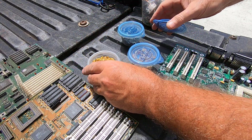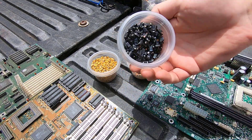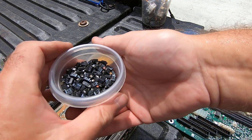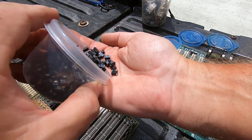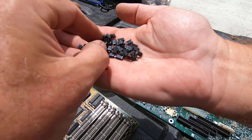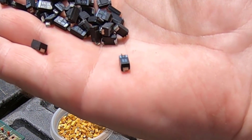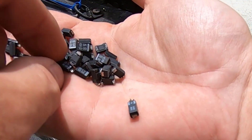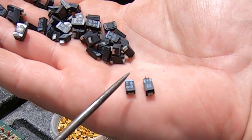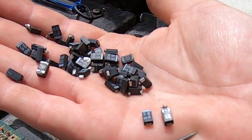So these are my working jars. I have larger containers that these get put into once these are full. And we'll start out with the blacks — here you see I have niobiums and tantalums all mixed together. Here you see a tantalum with the plus sign on it. And here you see a similar sized one with no plus sign. So this one is definitely tantalum; this one is probably niobium based on my research so far. I just keep them all in one place.